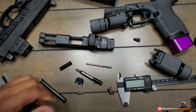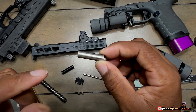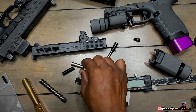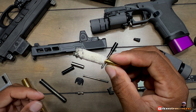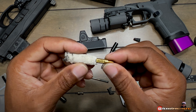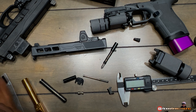One of the things about the channel liner is I polished it as well. When you get it, it's somewhat finished, but not just necessarily polishing the outside — the inside as well, because that's where all the action is going to be. If you get one of these little felt-type wheels — I got one that was for a .22 — and put it on the end of a drill, throw some Flitz on there, and run this felt wheel through it, you can polish the inside. So that's super dope. I'm really excited to see how that works together in the slide.